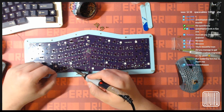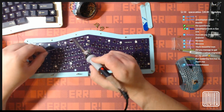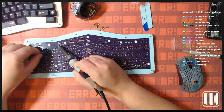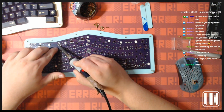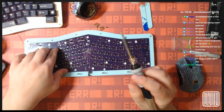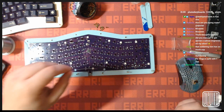So just as normal, we just want to lock in some switches so we can pop in all the rest of them. Make sure the PCB is sitting as deep as it can. Very important, because you don't have much space in this Alice case. So really push the PCB down when you're soldering, so it's really grabbing there. Because this case is tight.